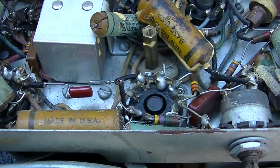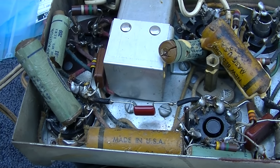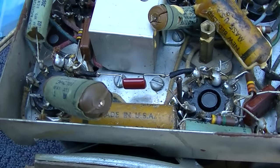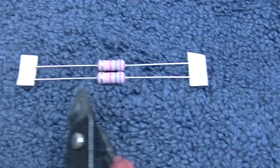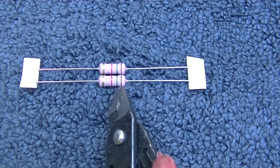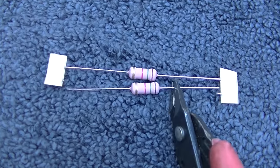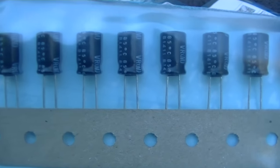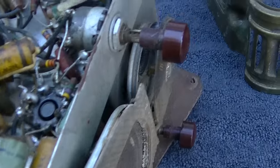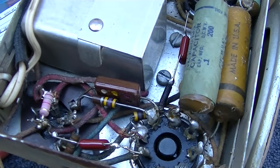It's better if I do the rest without the camera so I can concentrate and move fast. If I come up with something special that you need to see, I'll key up the camera. Also, when I get this cut-reel tape where things are taped in, I never pull the tape off if I can help it — that's basically trying to pull the lead right out of the resistor or capacitor. I just snip them. I try not to stress the components, especially electrolytics — you start grabbing on those trying to pull them out of the tape, you could pull the leads right out of the capacitor.